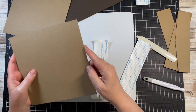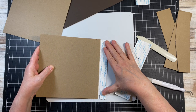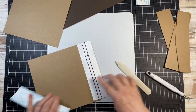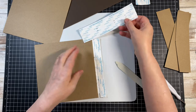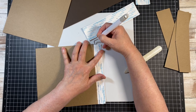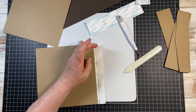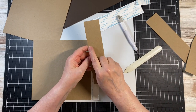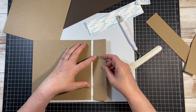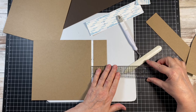I don't care if it's off up there — I'm just getting it on here. Score it. Then I will take the tape off this side, and take one of these pieces that measured 1 and 7/8 across and put that right down on the next piece. And then what I should have here is a quarter inch gusset — and that's what I have.